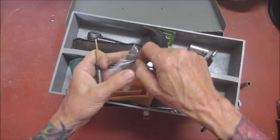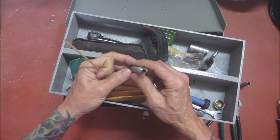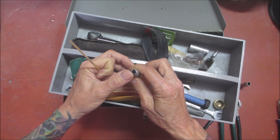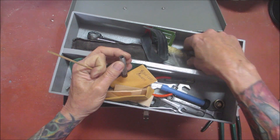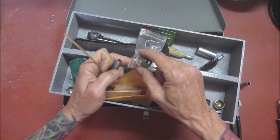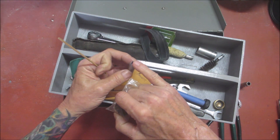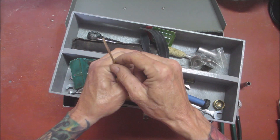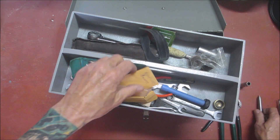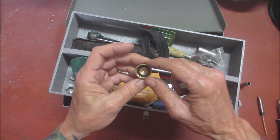We've got a couple of pumps, pump caps, and leather pump caps. I made this — I couldn't find a punch that was the exact size to fit the recess when the leather pump cap goes on, so I ground down this piece of mild steel. It's very sharp and I use it as a punch, and then this little skewer I use to push it out.